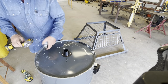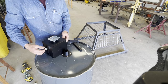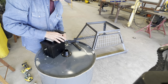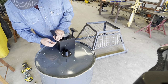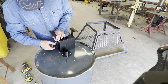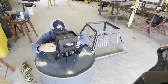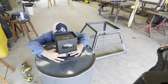I like to pre-drill all my holes in these barrels. Most deer feeder timers come with little self-tapping screws, but it's just easy to pop a hole in there real quick. Make sure you don't over-torque them — I've got a little DeWalt 12 volt driver with it turned down low, and that makes it easy not to over-torque those little tapping screws in the barrel. Just once you get them nice and tight, that's all you need.